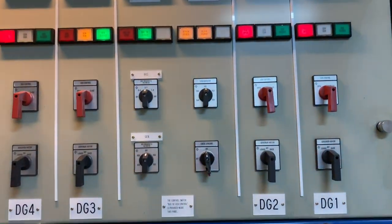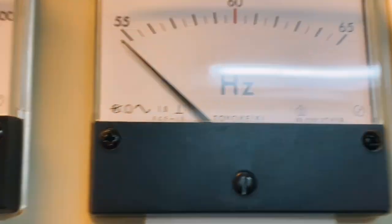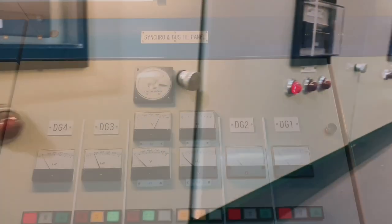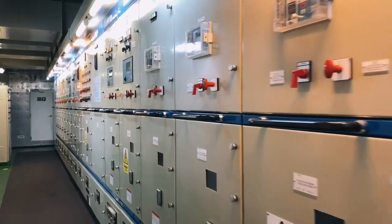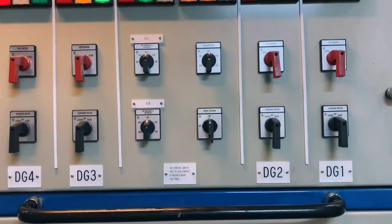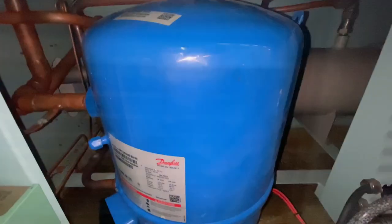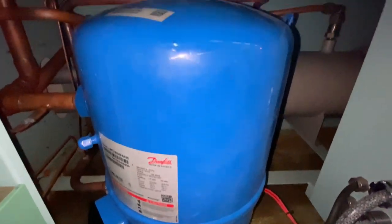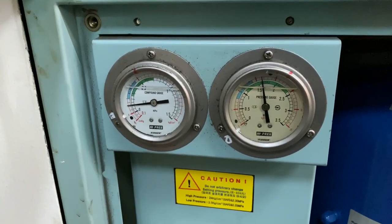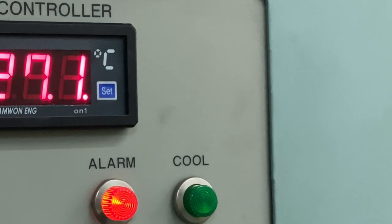This package aircon plays an important role in keeping the temperature inside the room in good range. Just like what I said, every time the compressor runs the suction pressure goes very low, and the suction pressure switch activates which stops the system from running.